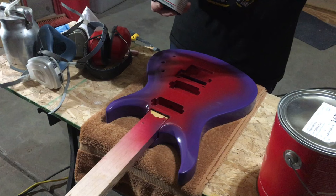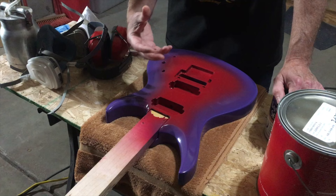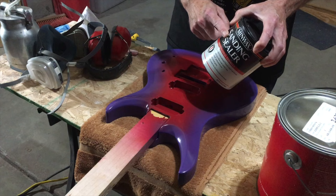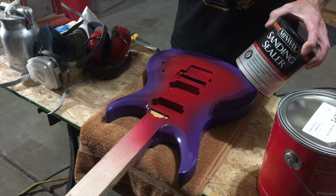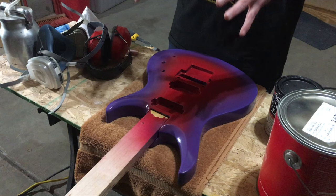If the wood that I'm using happens to be fairly dark, and I know that I'm going to be spraying a light color over it, one of the things I'll do is, after I've sprayed a couple of coats of the sanding sealer, pour some of this out into a separate container and then mix into it enough acrylic white paint to give the final coat a light opaque white color, and that becomes the surface that I'm going to apply the paint on.